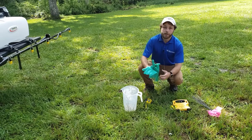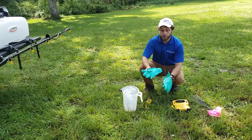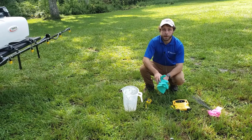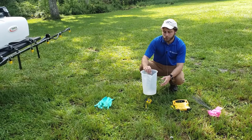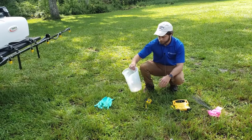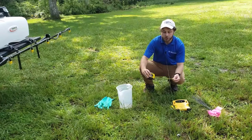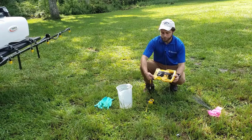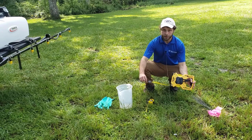You're going to need gloves — it's really important that you protect your hands and forearms when calibrating gallons per acre sprayed. Most pesticide injury occurs to the hands or forearms, especially during the mixing and loading phase. You're going to want a measuring cup large enough to catch solution for at least 30 seconds, a measuring tape to make sure each nozzle is equally spaced apart, and a 100-foot measuring tape to mark point A and point B to calibrate gallons per acre sprayed.